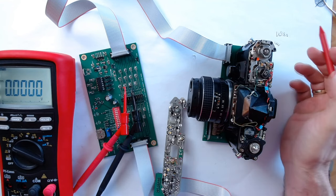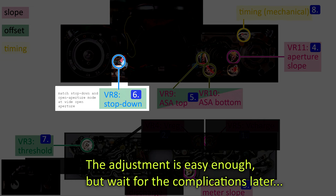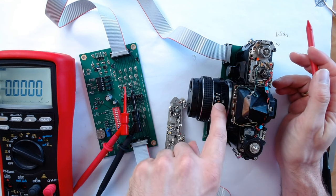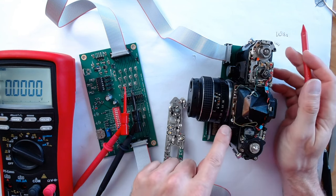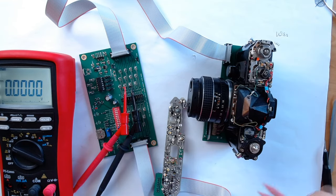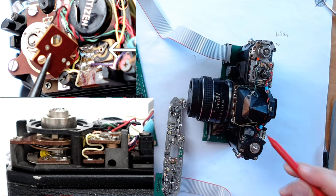Now we will calibrate stop-down mode, and this is a very easy adjustment based on the fact that when we set the aperture to wide open, stop-down mode and open aperture mode should effectively be the same. The only difficulty is reaching the trimming resistor that is hiding below this little circuit board for the battery test